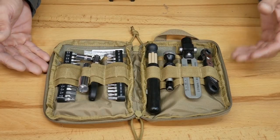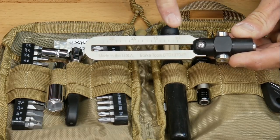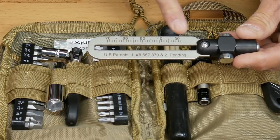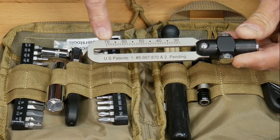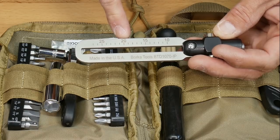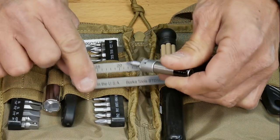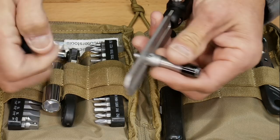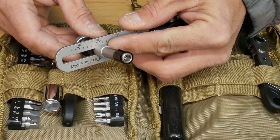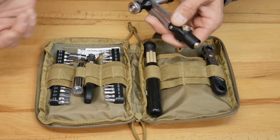So in opening up the kit, the heart of it is going to be the Borka Torque Driver. What this is, is a variable 10 inch pounds all the way up to 27 inch pounds on the low torque side. When you flip this over, it picks up at 28 and goes all the way to 70. What you do is take this piece right here — let's say we wanted to dial up 20 inch pounds. You take the spindle, remove the cap. You're going to see this arrow, and you place it where you see the number you're looking for. You put the cap back on just until it touches so you can still freely slide it.